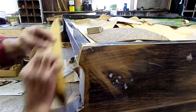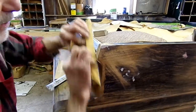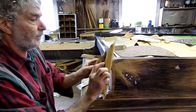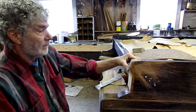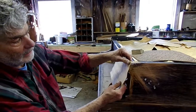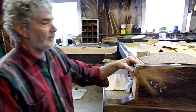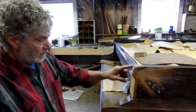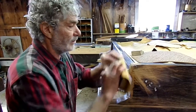You won't see too many of these in any piano shop — I guess they just don't believe in it, but I do. How are you going to get this flat? This is actually rounded a little bit, it's not flat. See how it butts up against here — our other piece of veneer is going to lay over that and overlap this so you won't see the joint. They damaged this also — this is all sanded round, all along here. That's a pain in the neck to deal with, so we're going to try to smooth this out.